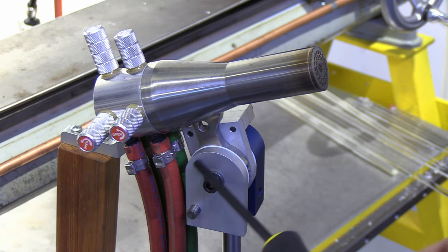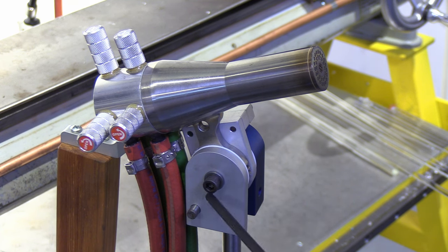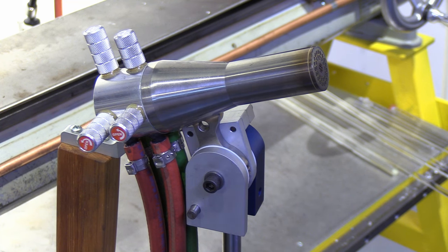So this plate is secured with a sliding pin — a precision pin in a precision reamed hole that fits fairly tightly — to keep this plate from rotating as you're tightening or loosening the screw. When the assembly is in action, there's never any force acting on the screw that tends to unscrew it. I'm going to take it apart now and show you the one tiny little tricky part.